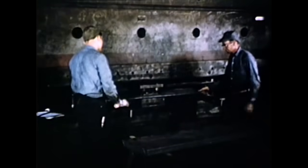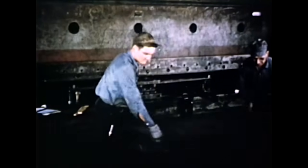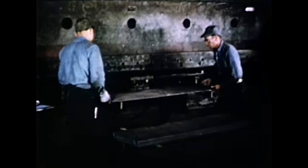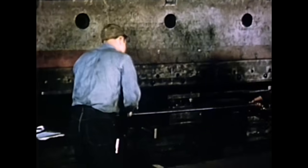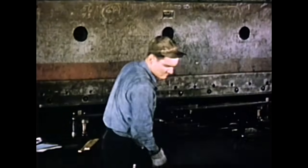Giant presses exert tons of pressure to form the precision parts of the rotocycle. With one stroke of the press, the heavy 3/16-inch steel cover plate is punched to accommodate a gearbox assembly. The finest in steel is needed to withstand the abuse this machine will undergo in the field. Modern industry has found the most successful means of constructing heavy machinery is to build component parts separately. The completed parts are all brought together for assembly.